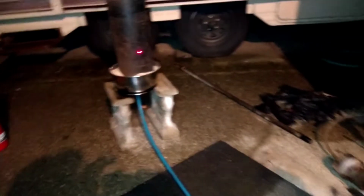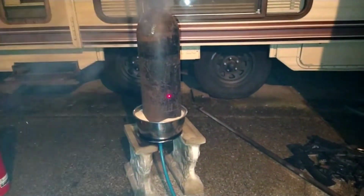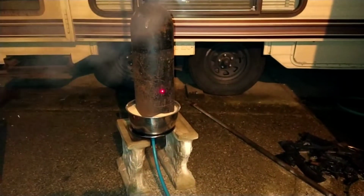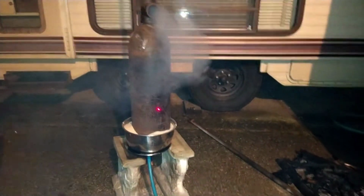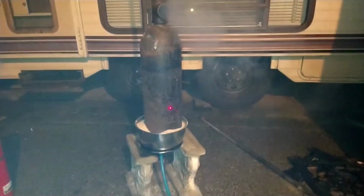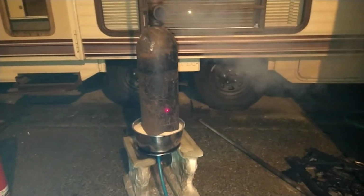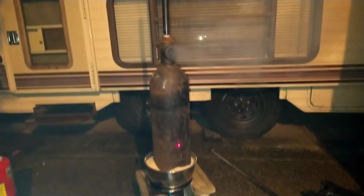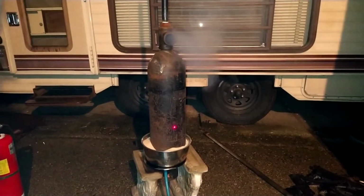Incomplete combustion. So what's happening, my best guess, is it's like a hot coal when you blow on it. So there's the hot coals in there and they're just expanding. And as they expand, the temperature goes up in this chamber. The walls of the chamber get hotter and hotter because they're steel. And it gets hot in there. And so what happens is it's cooking the remaining wood and kicking off all its wood gas and tars and saps. That's what's occurring. So we're doing the same thing as a gasifier, but we're just doing it in a different way. That's my theory, and that's what I'm seeing.